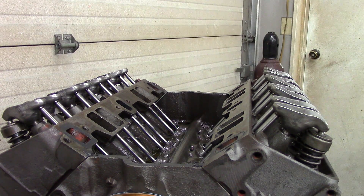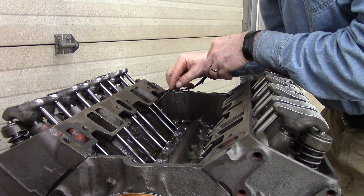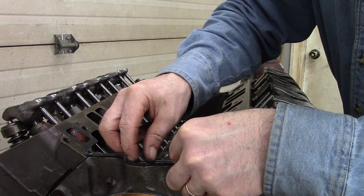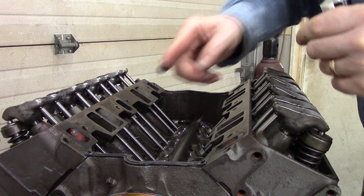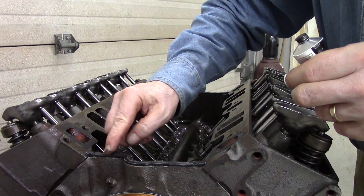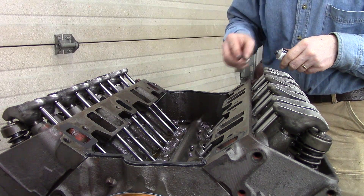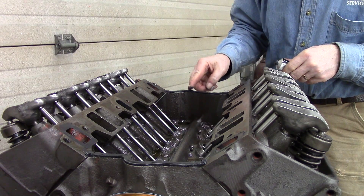When you're putting your gaskets in place — the side gaskets — they do say 'this side up,' so you want to make sure to put them that way. Verify that on your gaskets themselves. I installed the end rails and I'll put a little silicone there and there, and then just a smidge going along this edge. Call me paranoid, but I want this to hold up for a long time and I'm not fond of any kind of leaks.